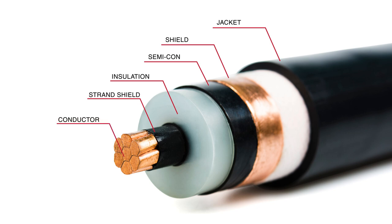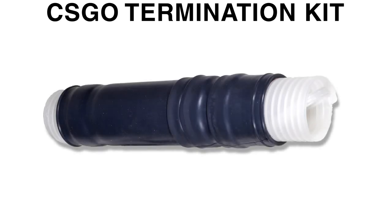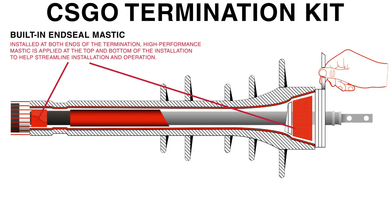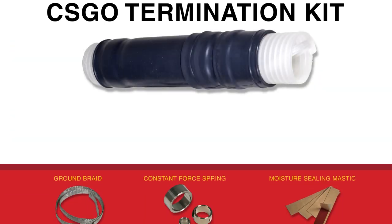Let's talk about the different components included in the purchase of your Burndy CS-GO Termination Kit. You'll have your cold shrink termination sleeve that is expanded over the plastic easy ripcord, which is now recyclable. One feature to highlight is its integrated mastic lining installed at the factory on both ends of the termination. This high-performance Burndy high-seal mastic makes installation easier and ensures a very high-quality, consistent termination.